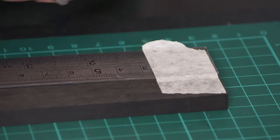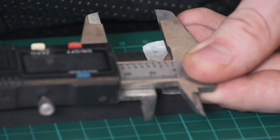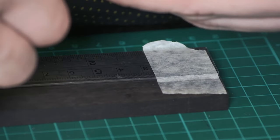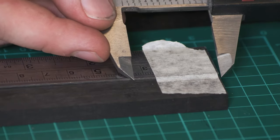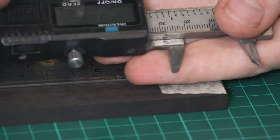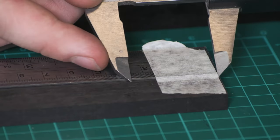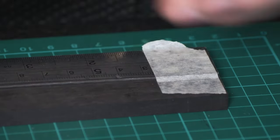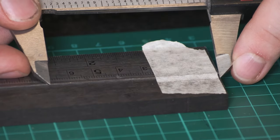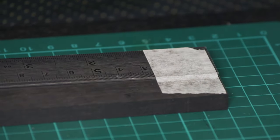If you feel you're not getting it accurate enough, you can use a digital caliper on the first few. The first one was 35.28 — right on the money. In imperial that'll be 1.389 inches — right there, right on the money. For 68.587 — there we are. Once you've done everything once, go back and recheck everything to make sure you're correct before moving on to the next phase.